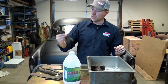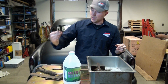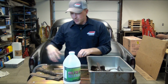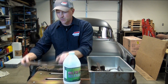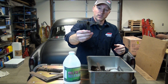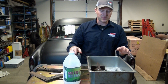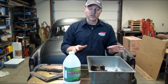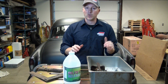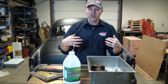I'm also going to take some old wrenches that were sitting around for a while. Not too bad, but they do have some surface rust, so I'm going to drop those in there. There's a fair amount of rust on them. I have a couple other tools — one has a wooden handle and the square has a wooden handle, so I'm not sure I want it sitting in there too long. We're going to let these sit at least 15 minutes. I think the hand tools after 15 to 30 minutes are going to be fine. I have a feeling the jack is going to take a bit longer — probably a good portion of the day or overnight, because it is really rusted.